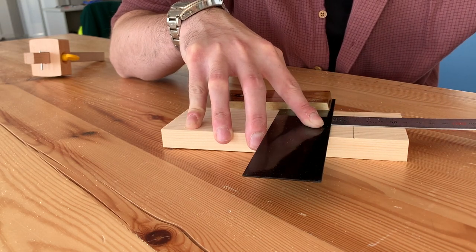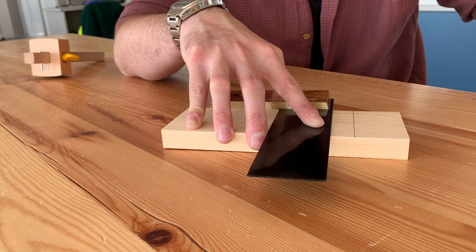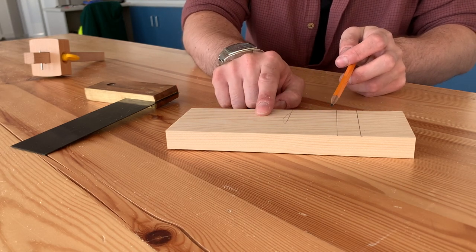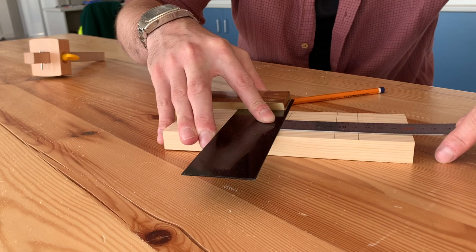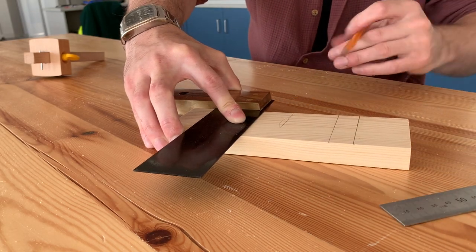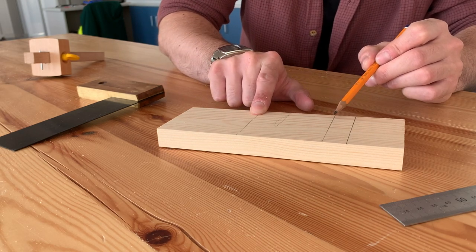There's 18 there exactly. Let's triple-check our measurements always, because you can always adjust your markings before you start cutting, but once you start cutting you can't fix any mistakes. So there's that line going across, and then the next thing is to come across and leave 70 millimeters to the next line. So to recap: 40mm from the edge to the first line, 18mm for the width of the trench, then 70mm over to the end line.